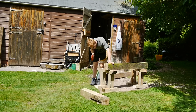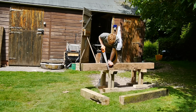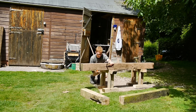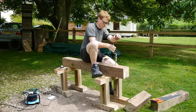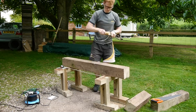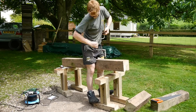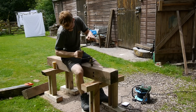The next thing to do is install large beams on the top of the walls. I used these old gate posts as they were pressure treated and should last a long time. To fix the beams to the wall I needed to drill holes through the beams. The only drill bit I could find long enough was an old-fashioned auger bit with a square taper. The drill bit was only just long enough, so I couldn't cut it down and use it in a power drill.